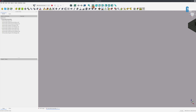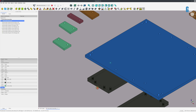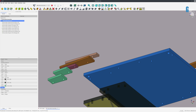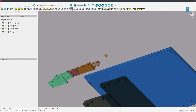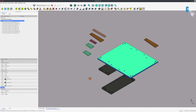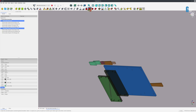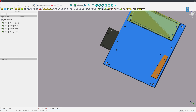I'll accept that — what it's done is aligned the two holes vertically. I found I need to do both holes, because it's effectively a circular constraint and the part can actually rotate when you're constraining parts together, which is not what I wanted. Now I need to make sure the faces are aligned correctly, so I'll select the top face of the base and the bottom face of the stone holder, then use a coincident plane constraint. Something has gone wrong — these mounting holes are fine but these ones are not, which means the holes in the base are in the wrong place.